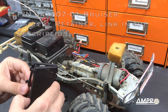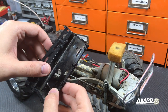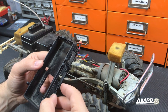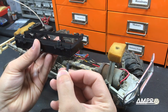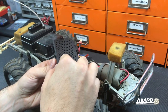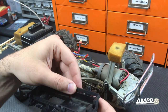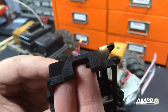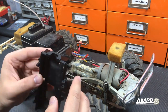So what we've got here are a few parts to modify this. The plan is to install this little bracket right here, which will thread into the base. Then you install this bracket here, which will adapt the bracket to the base. I needed this little in-turn bracket because otherwise I wasn't able to access the screw directly beneath the lower battery retainer. Like the HGP407, you have these two little clips which will screw in right here to sandwich the battery retainer in place, and then our door, which will simply tilt over and enclose the battery. The opening for the battery cables is very small on this, so I've left the opening I've created a little bit larger to allow the battery cables to exit at a less sharp angle.